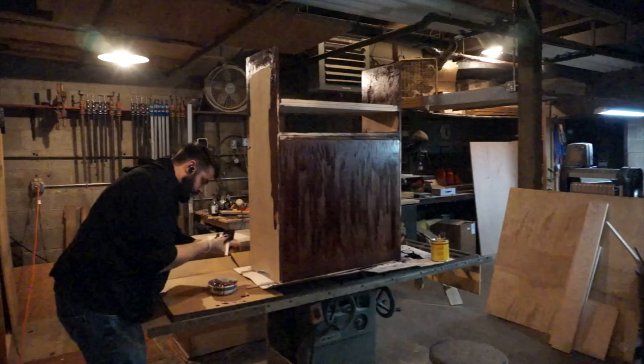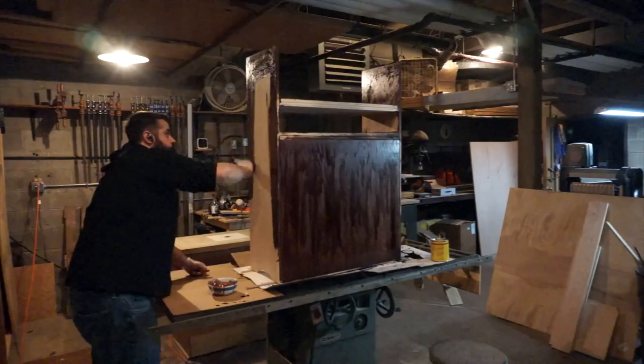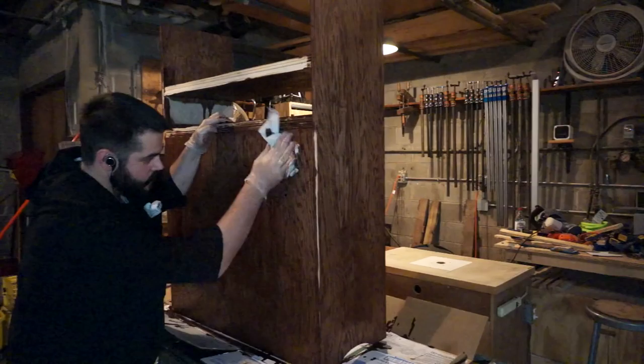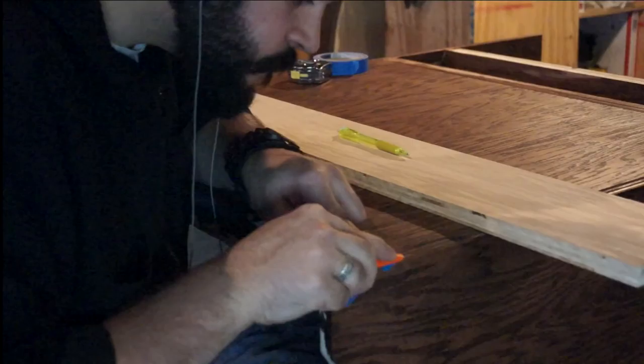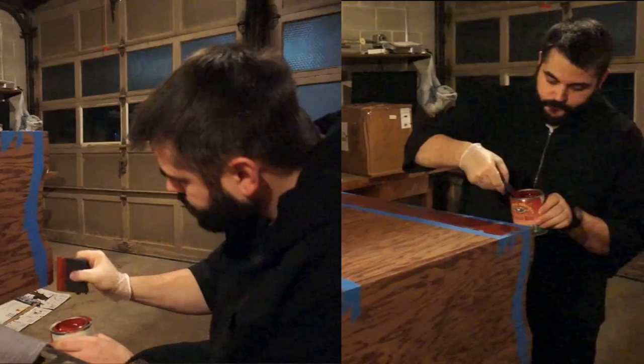One of the things you'll notice is I'm leaving some areas unstained, and that's on purpose. The edges of the plywood are all going to be covered with solid oak banding, and also the interior area of the drawer because it still needs to be thickened up to give it the one and a half inches just like the two shelves. Because I'm going to be laying out a design on top of the stain, I needed to make sure I gave the stain plenty of time to dry. The directions said 24 hours before applying any top coat, but because I was going to be putting a design on it, I actually let it set for about three full days to make sure all the oils were completely dry so the tape wouldn't pull up any of the stain.